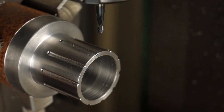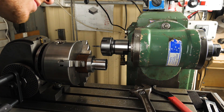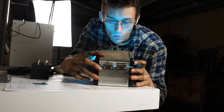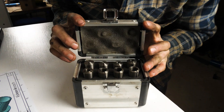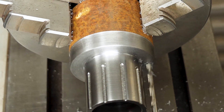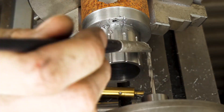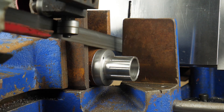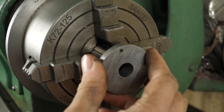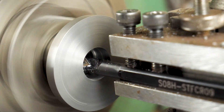My mill is actually fairly small, so to get the clearance for drilling I'm going to turn the head sideways. I figured why not use the dividing head while it's already set up. The collet nut is going to hit — I've got just the thing for this. It's just Morse Taper collets. This old setup came with this mill; I've never actually used it myself. These are Morse Taper 2 collets. We're going to use a Morse Taper 2 to 3 adapter. Now I just need to bore out for the rear bearing and this body will be done.